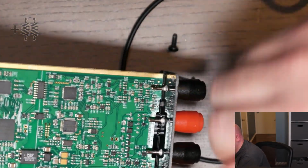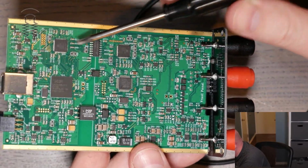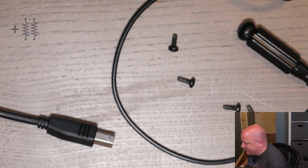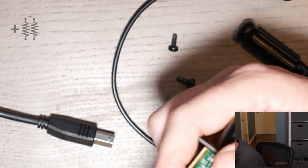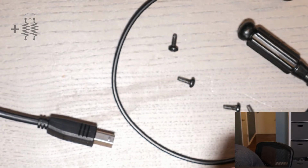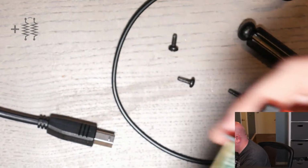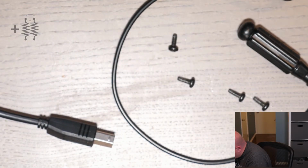Does it contain a Xilinx chip? It doesn't contain a Xilinx, but it does have 2 Lattice chips. I think the logo looks like Lattice, and I think it says ICE. I'm gonna wash this out for just a second so I can see it. Yeah, it looks like ICE 5LP2X. I feel like I'm at the eye doctor. Or ICE LP2X something. Yeah, so there's 2 Lattice parts on either side. And then it looks like optocouplers and such, transformers to do the isolation. But yeah, I just don't see, I thought we'd see a current sense. I wonder what it's doing. We'll have to look at that in more detail at some point. Okay.